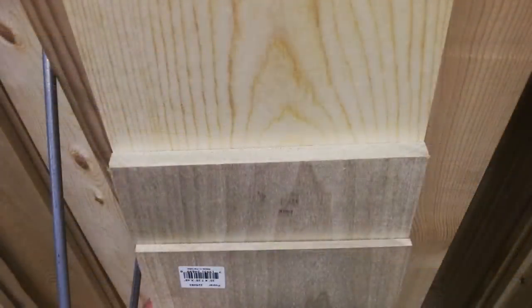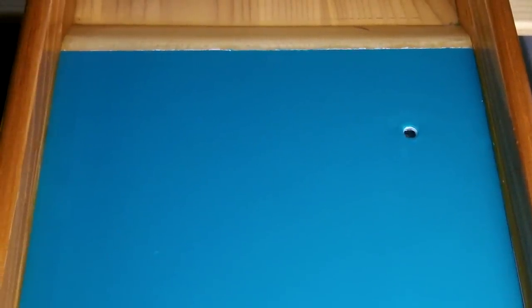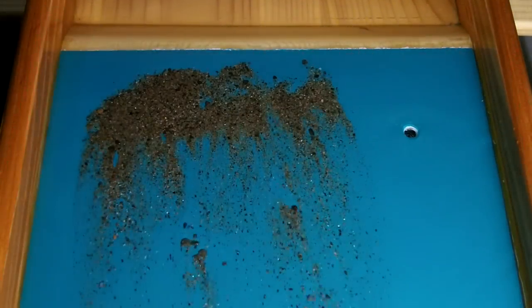The job is made easier because you can go to your local Home Depot store and buy dimensional lumber in three-quarter, half-inch, and quarter-inch that are all exactly the same width. Basically all you have to do is cut it to length and glue them together. If you notice, the flow is very smooth, and this is what I wanted for trying to collect the very very fine gold - you need a really smooth water flow both in your sluice and on the miller table.